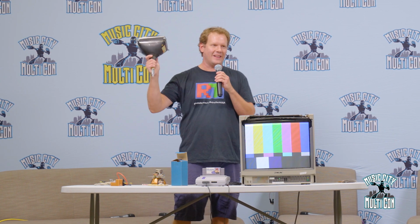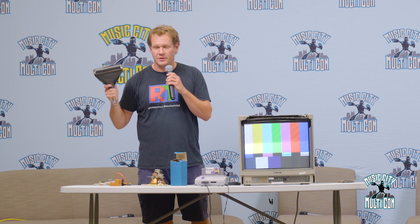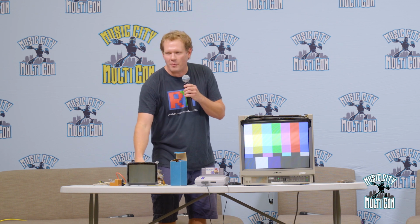This is not an environmentally safe item. It's lead-lined glass full of tiny phosphors and all this stuff that is very harmful to the environment, to humans, and to any animal, really. So you can't just recycle this as normal glass. It can't be turned into artisan beer bottles or something. It's very limited what they can do with it. There are a few places in the world that can accurately melt this down at high temperatures, separate the lead from the glass, and then recycle it. But there are literally only about 5 places in the world that probably do that.